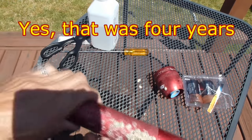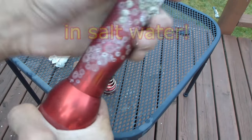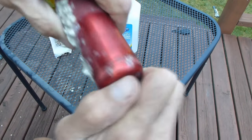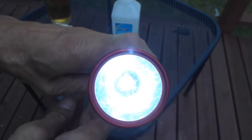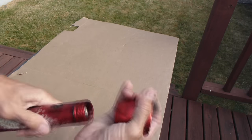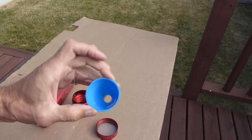And wow — unbelievable. We still have basic function on this light. Now the rubber coating on the switch is completely gone, it's consumed. The reflector — the mirror coating on the reflector — is completely gone. All that is due to electrolysis of the seawater, and of course it's been sitting at quite a pressure as well. But I'm impressed, so I'm going to keep this. This thing is plenty bright just the way it is, but it'll be a lot brighter if we can get a new surface on that reflector.